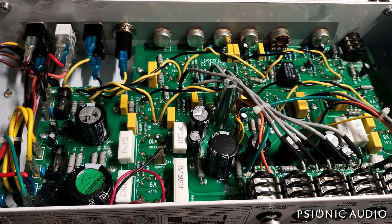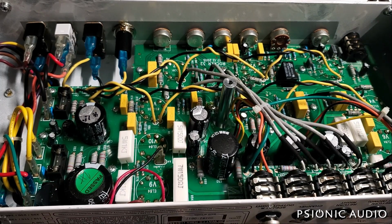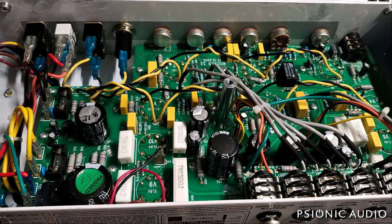Now I've got this orange Rocker 32. I've not had one of these in before. Essentially, it's two AC15s. So you've got a preamp, which is all mono, and then it splits to two different outputs with two different output transformers. Each output has got a pair of EL84s. And the complaint the owner has is that the amp is silent on every issue. There's no output. So I don't have a schematic for this. Never worked on one before.